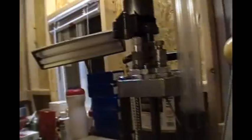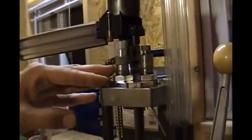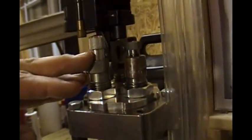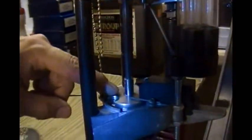The first order of business is to discuss how you do this. The first thing we need to do is get the turret off — that's this part here. That will pop off. Once we get this turret off, then we take these tubes off. We can do those in either order, but that's the order I choose to do it. These are simply your case feeder tubes that plug into the case feeder mechanism, which is down here. Once that comes off, then we remove this assembly here. This entire assembly is called the shell plate holder assembly. You have your shell plate, which takes the place of a shell holder, your primer feeder, and your case feeder. That's actually the case feeder right there.